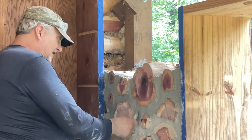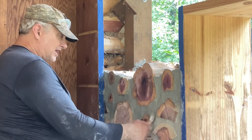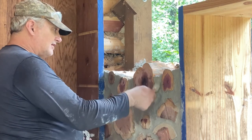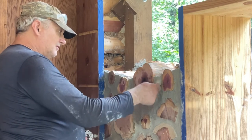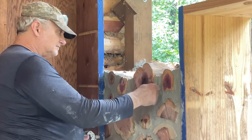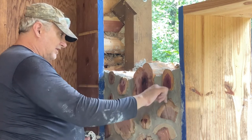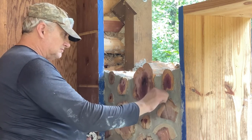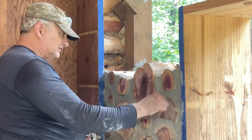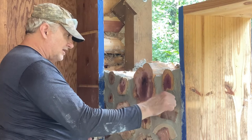Since that's what she likes better — and personally I kind of liked it better too — that's what we do. And that's the beauty of doing this. When you go buy a house in the suburbs or something already built, you get whatever their vision was, whatever their talent level was. But when you're doing a cordwood home on your own, you can make it what you want. We like the look of the mortar more flush with the ends of the logs — it gives a slightly smoother-looking wall. And if somebody says that's not right, I haven't found anything that tells me one way or the other makes a structural difference.